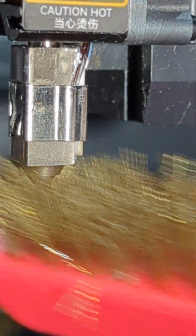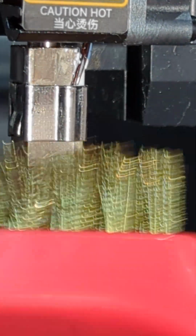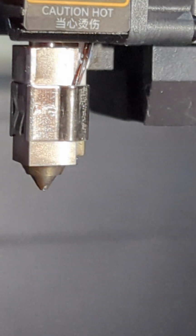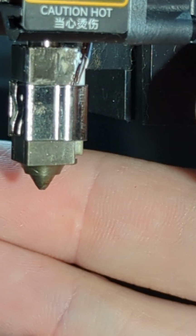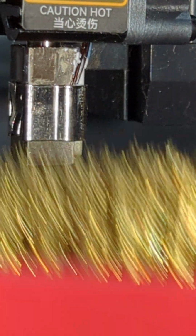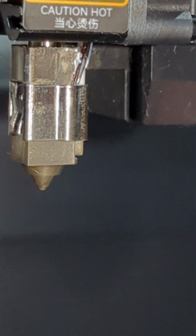Now, one thing I also do is I use a little bit of the plastic repellent paint from Slice Engineering. I usually put it on maybe once a month, 100, 200 hours of printing. It just depends. Once you start seeing buildup like this, you want to make sure you clear it out. See, now it's nice and clear. Don't touch it though. But you can see where it's got that nice clear nozzle there. This will help with getting a lot of filament, especially PETG. There we go. It's pretty good.